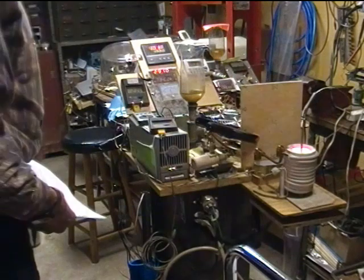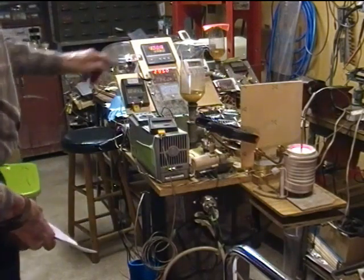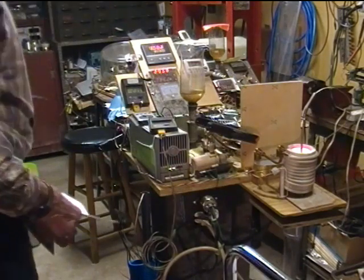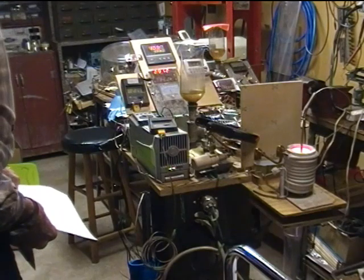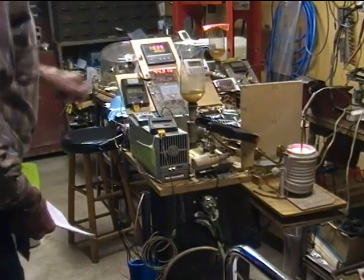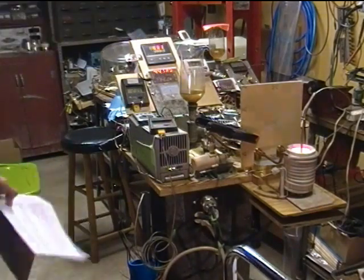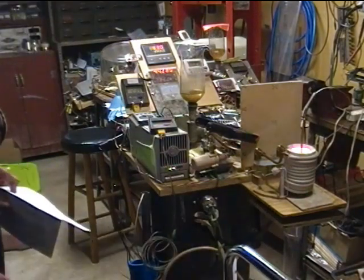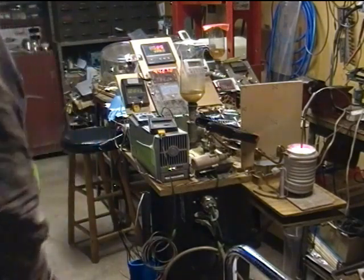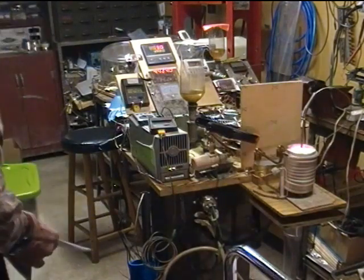With the power off, this is just noise in the frequency counter, which doesn't really matter at all. In fact, some of that noise may be coming from the PID controller itself. One degree below 1000, the heat came back on again — and it works, 38 amps again. This is a positive thing after the failure I had with a 100 amp unit SSR that failed at 20 amps. So now we're cycling on and off.